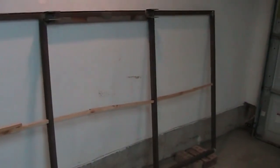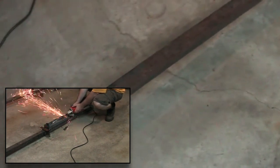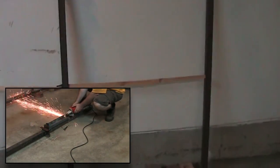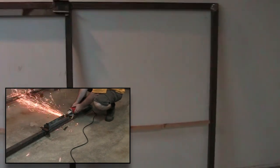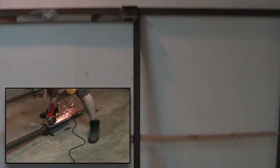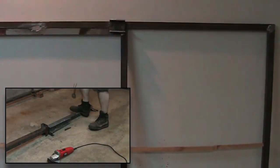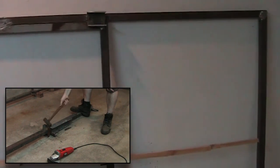Here's the donor tongue — this stuff has to get hacked off, it has no purpose in the new model. The frame is ready to go. The tongue is 40 inches from the ball to this boundary right here, which gives me tons of space. If I hack those two things off, my mounting will go right about there and I can cut quite a few inches off this pipe, because it's going to join between the two members on the front of the trailer. I'm going to weld in another beam across in front of the suspension shackle with a couple of 45-degree bars to spread some load out in the frame.